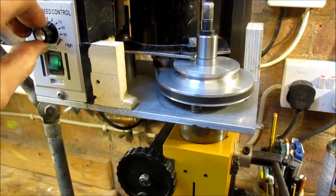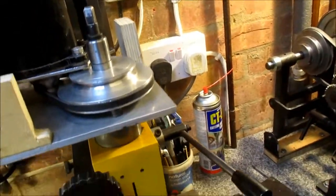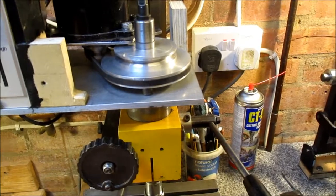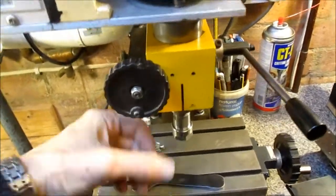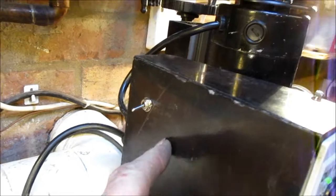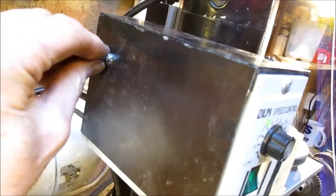I find that cutting with a 10mm end mill I can go quite deep into mild steel — 20 to 30 thou at a time, no problem. It's also very nice for power tapping: use it in drill press mode, press gently on the feeder, put a tapered tap into your hole, turn the power on very slowly and it'll tap in nicely. The only problem is you've got to turn it backwards to get the tap back out, unless you put a reversing switch on — which is just pretty standard wiring, no problem at all. The output, instead of going straight to the motor, goes to the center of a pair of changeover contacts, and this is forward–off–reverse.